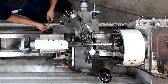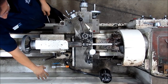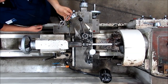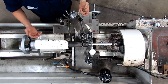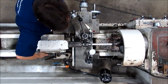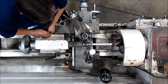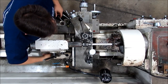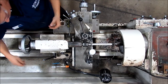I'm going to undo the locking screws. It should be a slightly bigger flat tip for this — I just have trouble reaching my big flat tip in here. All of our lathes are metric, this and the Kingston, so we're going to be using a 6mm wrench. One of the tricks to this is I need it to go this way, so instead of loosening this and tightening that side, I'm going to pre-tighten this side and then push it that way, and take pressure off the other side to move it back.